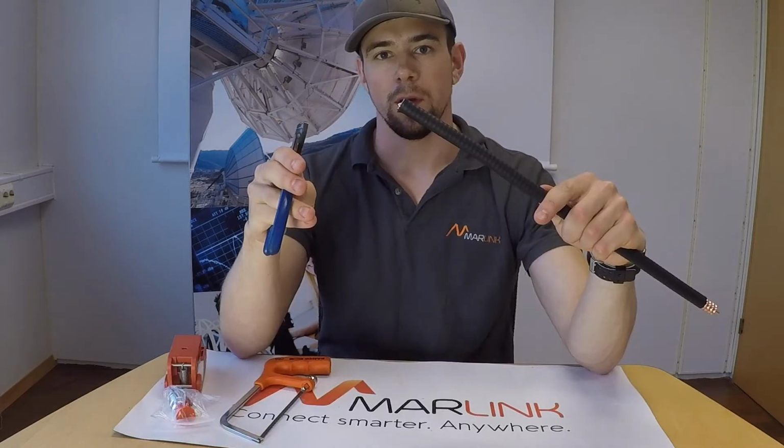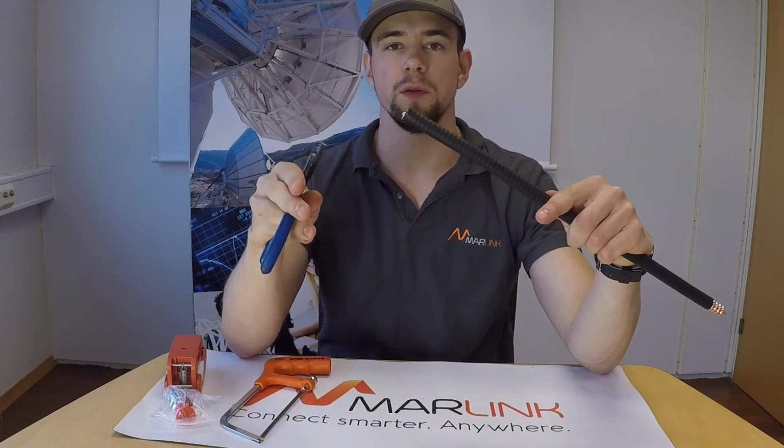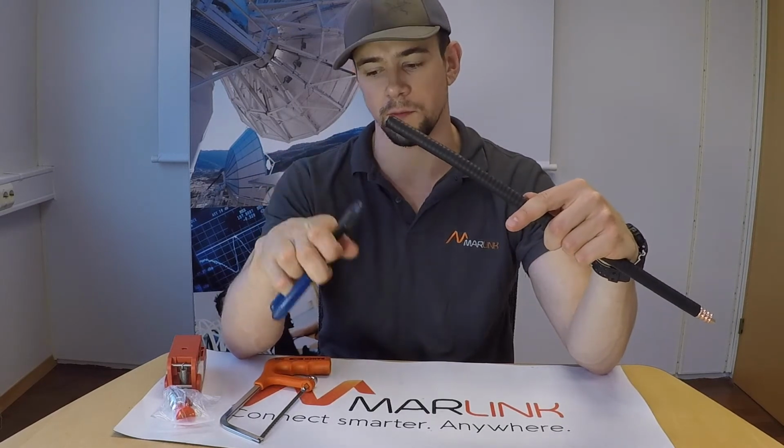Just like for the Cellflex SCF cable, Cellflex provides an optional trim tool for the LCF cable. If you do not have this trim tool, it may be replaced by a ruler, a file, and a flat screwdriver. You begin the preparation of the cable just like with the other cable. You cut the cable to the appropriate length of your installation.